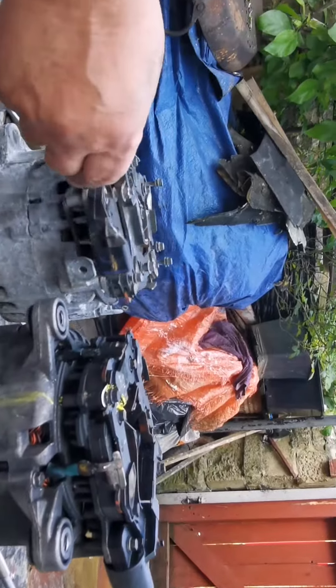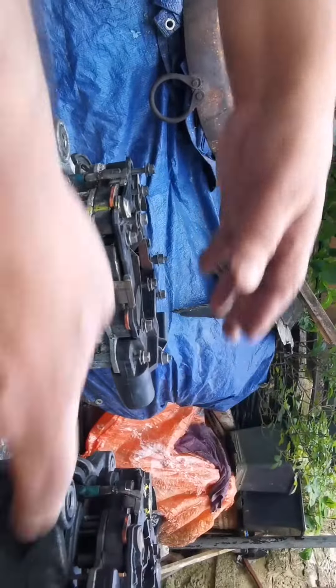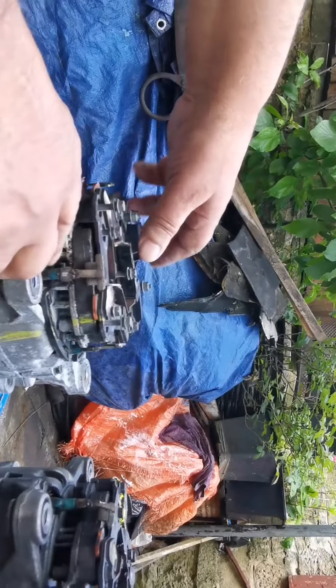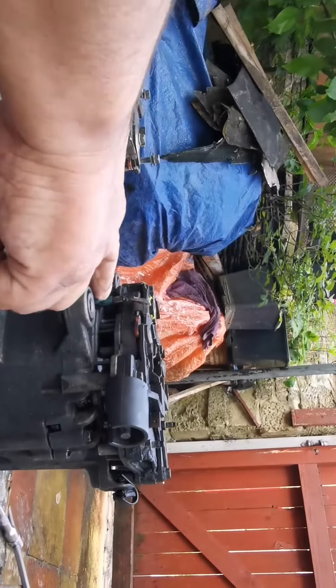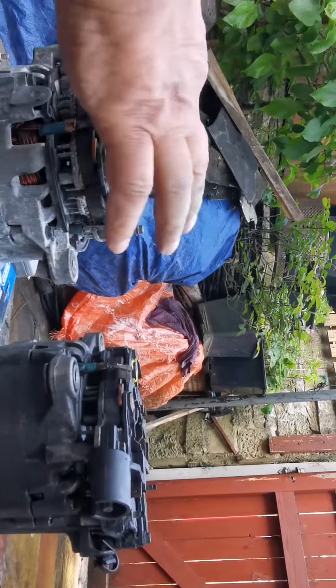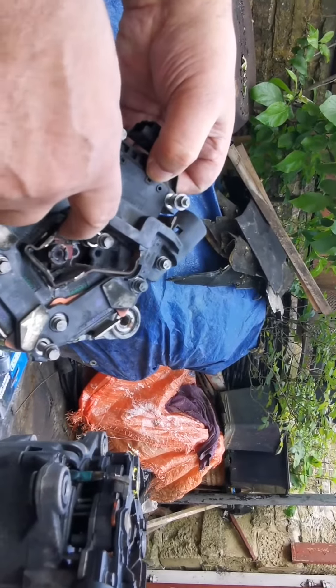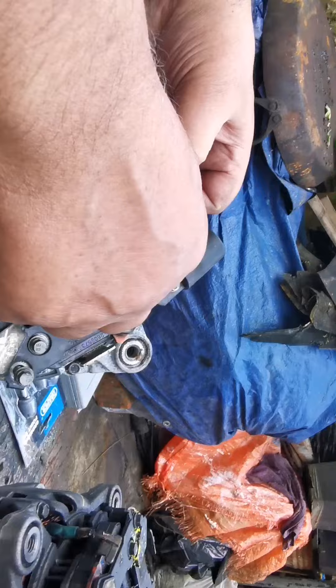The same thing on this part — it's got to be ground off on the outside. We're going to disconnect it, and then we're going to change this part onto this one here, and then we're going to solder these two parts. Then we're going to fit the carbon brushes into this assembly here — you take this part off, it goes up here, and then plug this off.